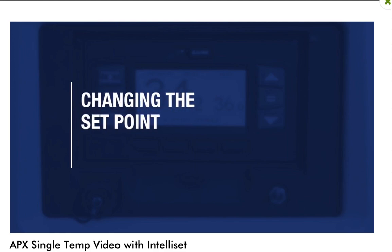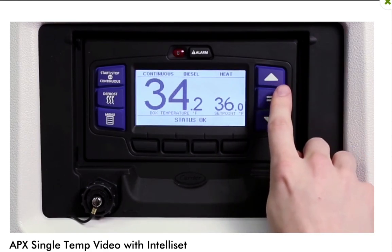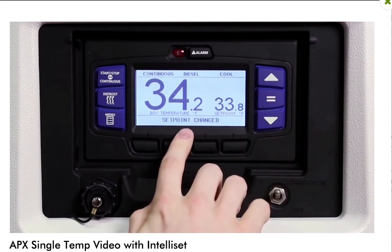Depending on the specifications of the load you're carrying, it may be necessary to change the set point. To change the set point, press the up or down arrow keys to the desired set point temperature. To save the new set point, press the equal key. The message center will display set point changed.